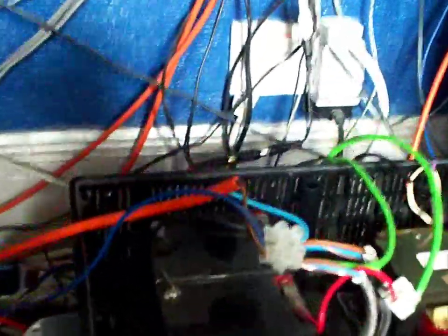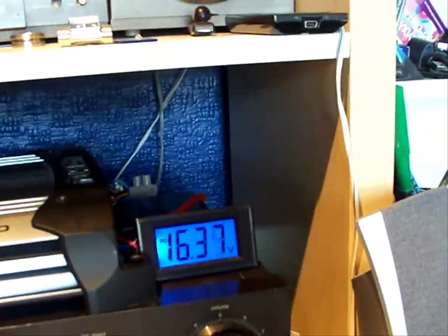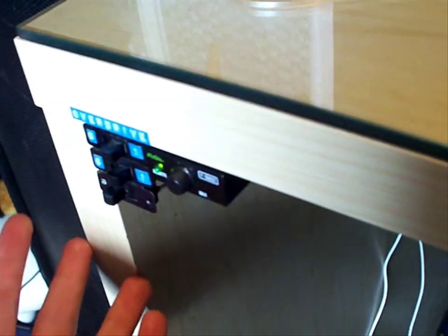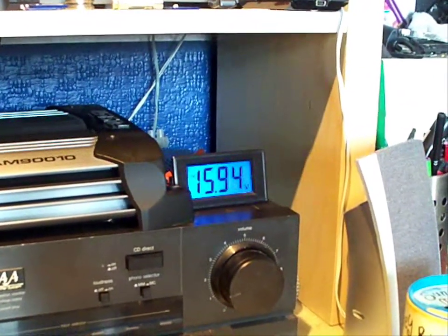Success comes about when I use a thinner wire — this orange piece of wire, much much thinner than that power cable I have with the amp. Now I've got 16.3 volts which enables my amp to power on, which brings it down to about 15.3 volts.